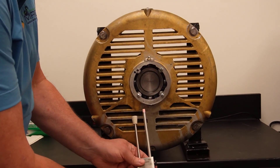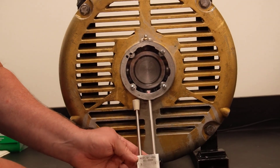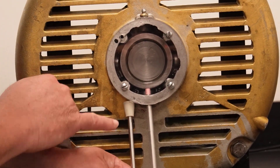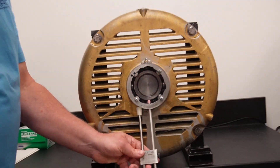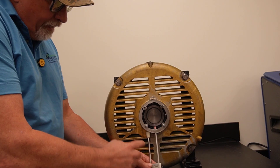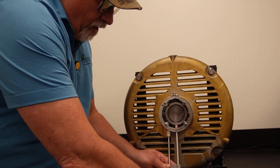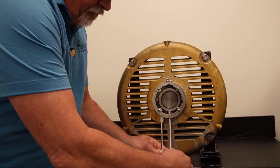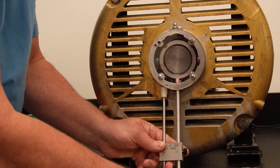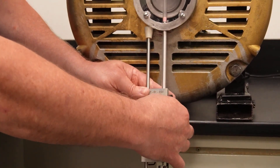What I'm going to do is come up from the bottom. I'm going to go through that opening, and then I'm going to go until I stop, and that's my offset. So I've gone that far into the machine before I'm going to start coring my sample. Now that I'm holding this fast to the side, I can bring the slider forward, first loosening the thumbscrew that lets this travel, and then I bring that forward to core the sample.